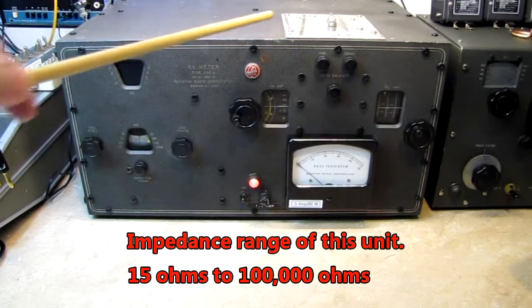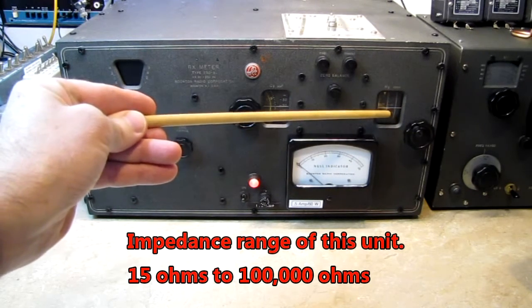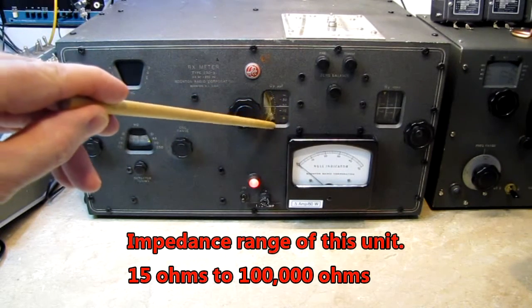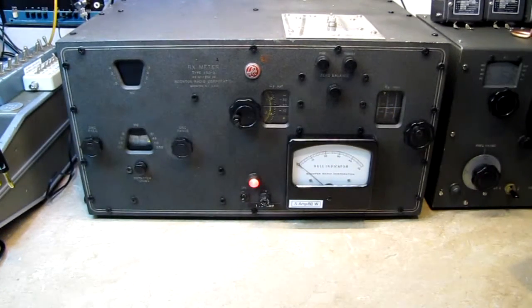At any rate, this one has the binding posts. We'll show you briefly how this machine operates and how it reads out reactance or impedance directly on this scale — after you've selected the frequency, resonated an inductor with a variable capacitor, very accurately marked, and then nulling the meter will result in the exact reactance or impedance of the tuned circuit. Then we'll do a brief teardown and show you what you got for your $1,250 on the inside. So let's get started.